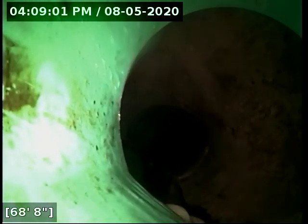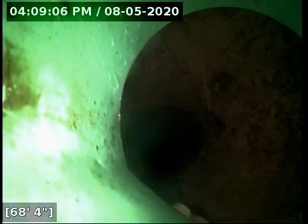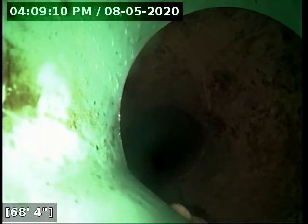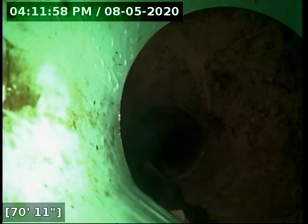We're gonna turn the water off here. We'll drain everything out and then try and scope further from the exterior cleanout. My camera's running into a little ledge there as we go through that clay pipe. All right, I've turned the water off here and I have the line draining out so we can take a good look at this portion of the sewer line.